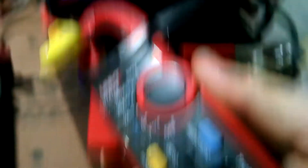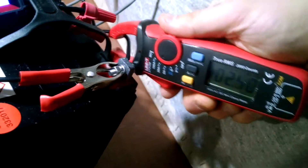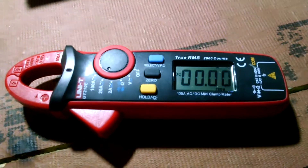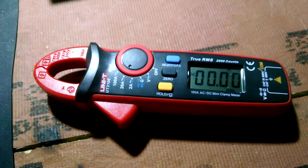That reads 5.4 on the other meter — I'm not sure which one is more accurate, but it's close enough for my work. And then we can compare it to what's coming in: only 2.5 amps. So we're using twice as many amps as what's being supplied. That's disappointing because it's a 100 watt panel, but it's just not putting that out anywhere close to it. So I'm not a big fan of the Harbor Freight panels, but I really like this multimeter. I recommend them — check the link below.